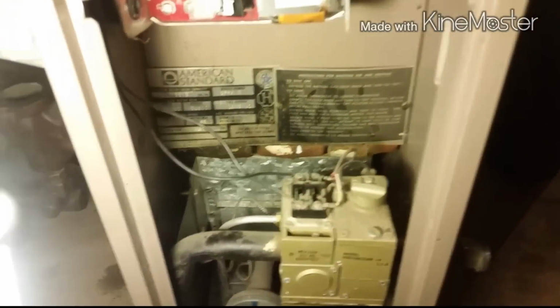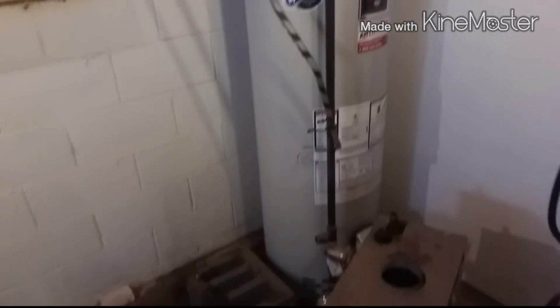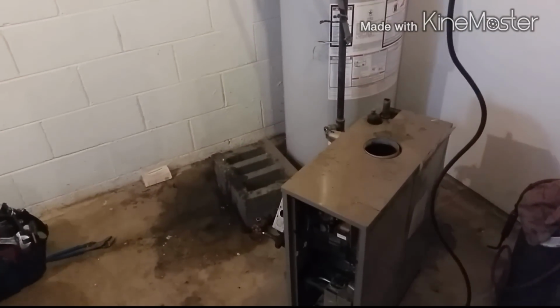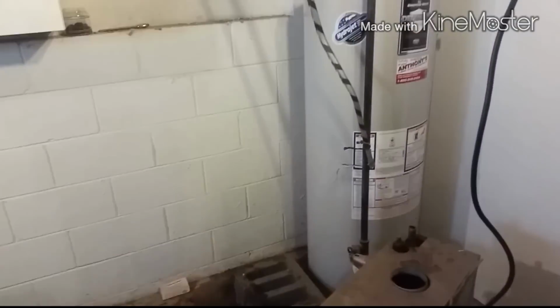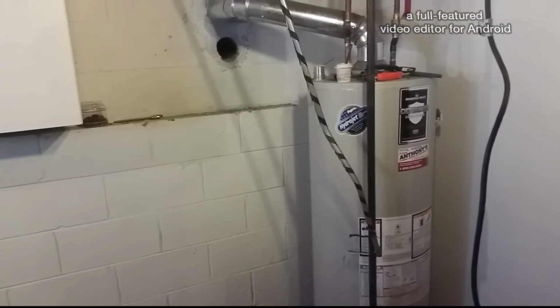This is only a, gosh, I think it was 66 input. Going back with a 303 Burnham. 62,000 input. Smallest boiler they make, basically, but the new one will also be 4-inch, so the flue shouldn't be that bad.